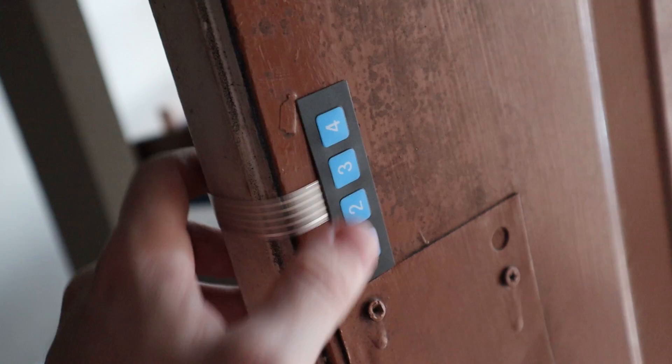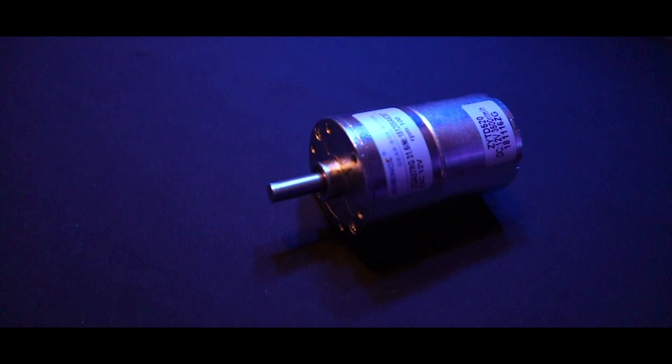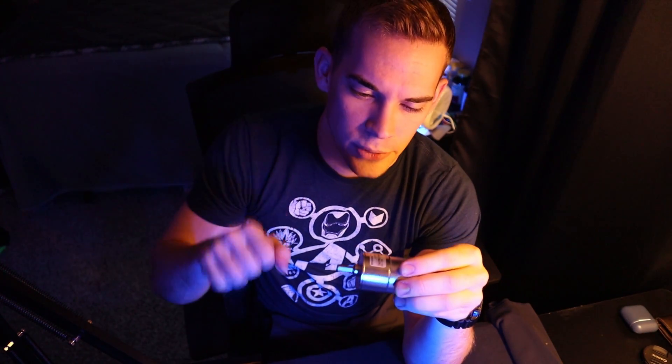Another day's passed and I'm just going to try to figure out what I'm going to accomplish with these little wireless relay things. What I want is to extend the leads on the keypad so it's just the keypad outside — nobody can steal anything — and you press one for Nathan, two for Ty, or whatever. The signal gets transferred to our rooms respectively. I have a good idea for him, which is just a little light-up LED thing as to not freak him out. And for mine, I want to make it funny and stupid. I think it would be hilarious if when someone presses the doorbell button, it's actually knocking on the bottom of my desk. I got this little cheap 100 RPM, 12-volt DC motor. I'm going to run this off the relay, attach something to it, and stick it under my desk so when it spins at 100 RPMs, it'll knock the bottom of my desk at the rate of someone knocking on the door.